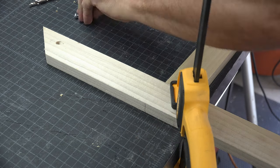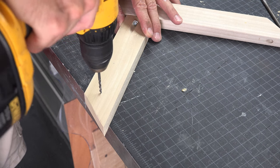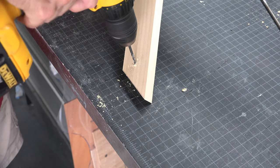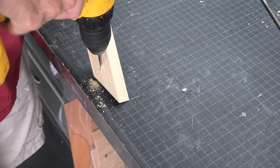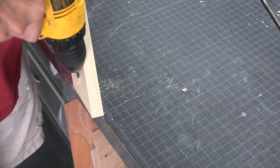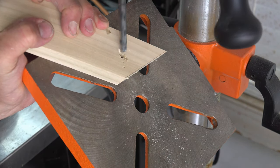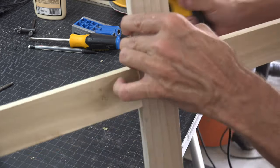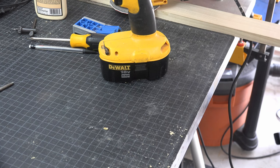With all the pieces cut, we can now join them. With your pocket jig, place pockets on the inside of the smaller pieces. Line them up so you know which ones go inside and face outward, then set those into the larger cross. With each cross complete, we will make pilot holes to make our job of installing them a lot easier. Start by laying the cross flat and drilling into the face — just break the surface. Once you have, pick up the cross and place it on its feet, then drill the rest of the way through, going all the way through the bottom of the feet. Now that you have a pilot hole, take a larger bit and make a countersink hole — this will allow your screw head to be hidden on the inside. You can use a hand drill, but if you have a drill press, set the table at an angle and make your countersink holes. For the tops of the cross, since they will be on the underside of the table and not visible, you can just drill holes right through the feet, but you should still include countersink holes for them.